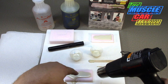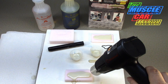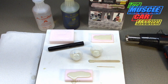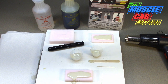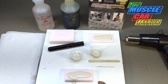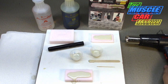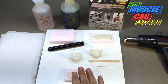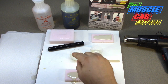The heat gun helps transfer the heat from the resin into the mold to harden it. If you've got a deep mold with a lot of deep cavities, it gets harder to get the heat in there because the silicone can soak up that heat and the part will stay soft and flexible if it even hardens at all. That's what makes smaller parts so much harder to cast - the mold pulls the heat away and makes it harder for the resin to work and harden. The heat gun really helps with that. I'm going to pause for a bit, let this harden, then do the two-piece mold and start pulling some parts out.